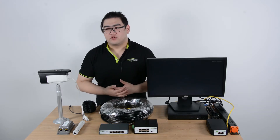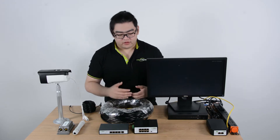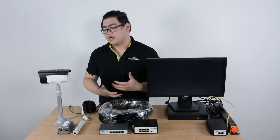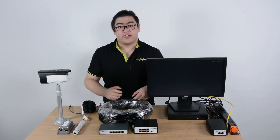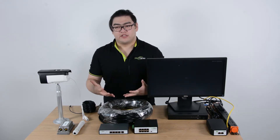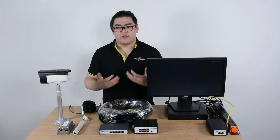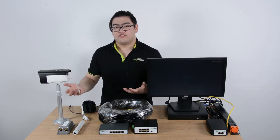For those of us who are not really familiar with PoE technology: PoE technology is the method we use to transmit both power and data through one Ethernet cable. In this case we don't have to worry about power supplies near our IP devices and everything will be really easy to set up with one Ethernet cable — very easy and clean. Although PoE technology is limited to 100 meters, which is 328 feet, what should we do if we want to break that barrier? After that point the signal will drop and the power might not be enough for the edge device.